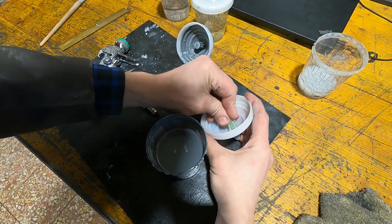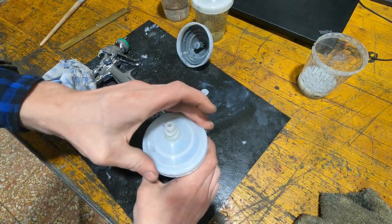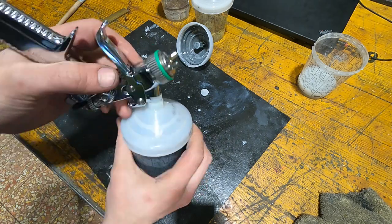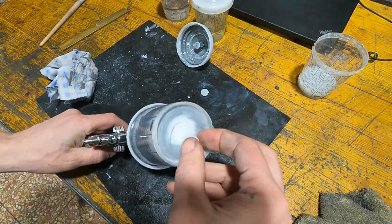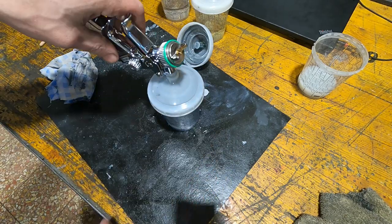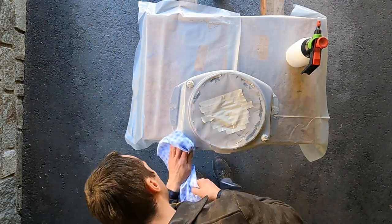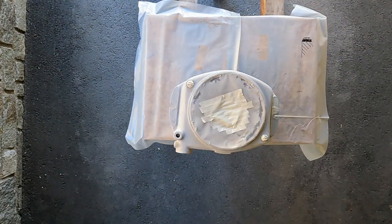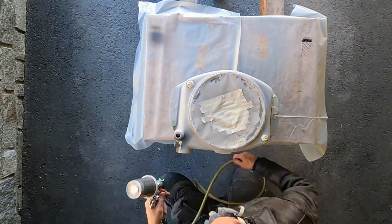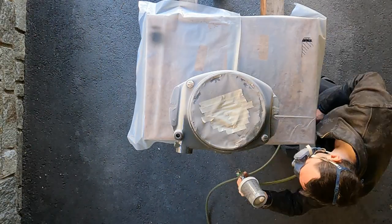This is the integrated bottom filter in the RPS cups, and this is how the cup connects with the gun via a quick connector. Never forget to open the top valve when you start painting — otherwise you draw vacuum into the cup and get no paint. Now one last silicone cleaner cycle, which helps calm the nerves: we must not mess up the job in the last five minutes after all these hours of sanding and masking.